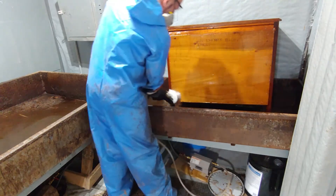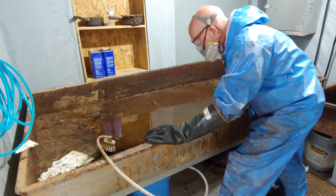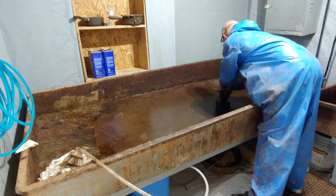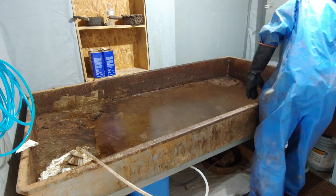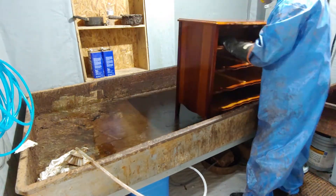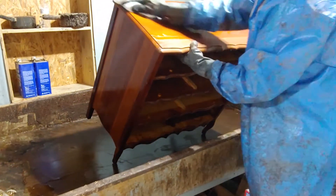I'm doing the same process on the case as I did on the drawers — making sure I clean everything off, wiping it all off well, doing the back and underside to make sure I get all that stripper residue off. I'm going to roll the piece back over into my stripping tank because I need to roll it around to wipe it all off — my wash tank is a little too small for a chest of drawers like this. Using the squeegee to make sure the bottom is clean with no stripper on it, pushing it all to the corner so that when I roll it around I don't get any more stripper — with its wax — back on it. I want to get all the wax off, not add any more.